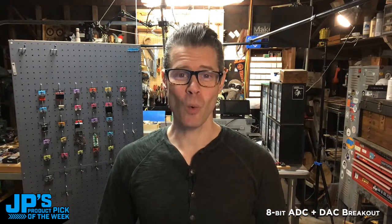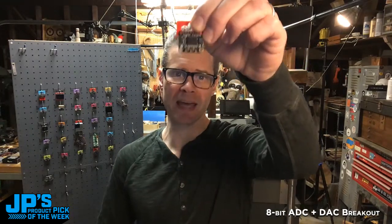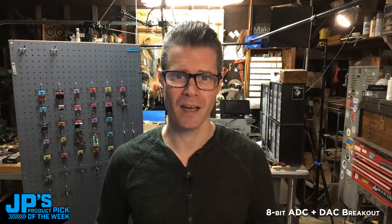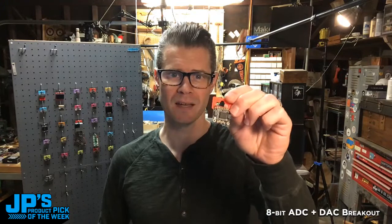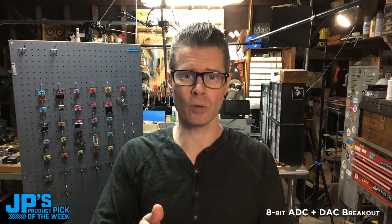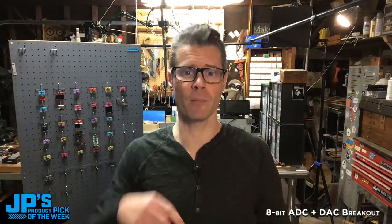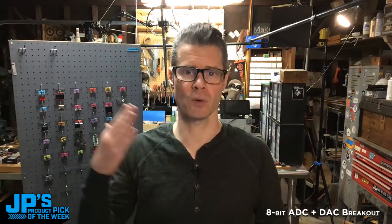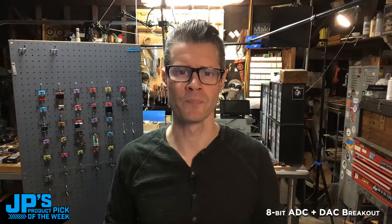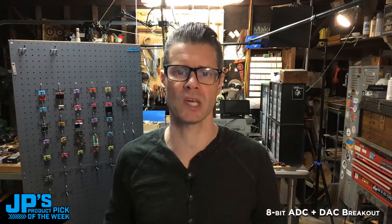Thanks, Lars. So what we've got this week, it is the PCF8591, and it is an 8-bit ADC and 8-bit DAC on a board with STEMMA QT. So what's this good for? Why do we want this? Well, a lot of the times when you're doing microcontroller projects or particularly single board computer projects, you'd like some simple input from a fader or a knob, so a slide potentiometer or a rotary potentiometer, is that what we call them? Angular potentiometer? Or other things like touch interfaces, some of those soft pots, things like that.